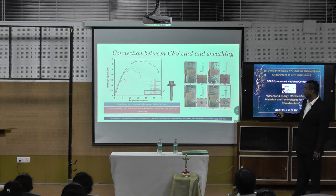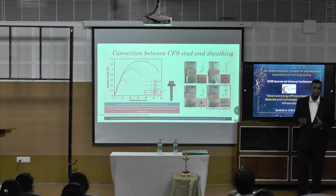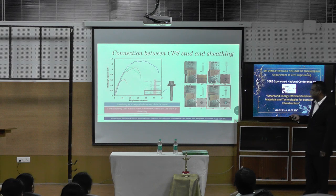You see that it is going up to this point, 1.4 kN, and has a large deformation capacity, because ductility is very important. So that is also one more philosophical lesson, okay. You cannot judge, you know, they say jackfruit, right? Just from external experience, you cannot. So this is an interesting experience, and why this is giving the highest amount of load is that washer. The washer is actually preventing the pull through here. The one that has a washer prevents pull through.